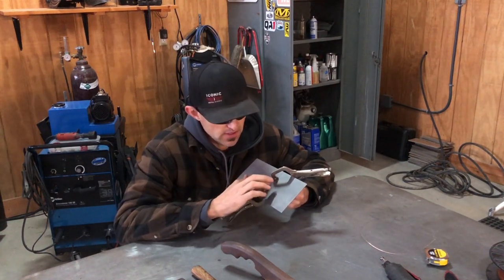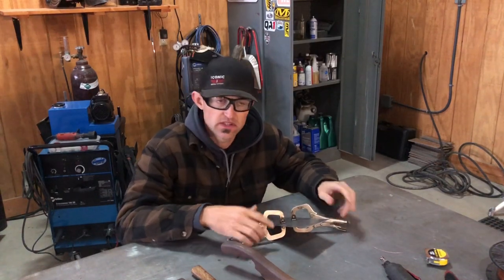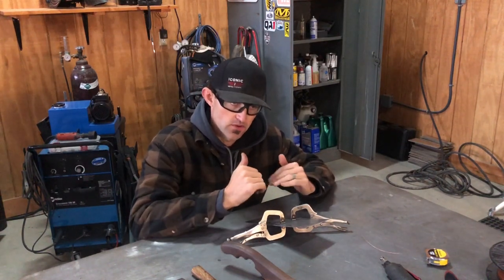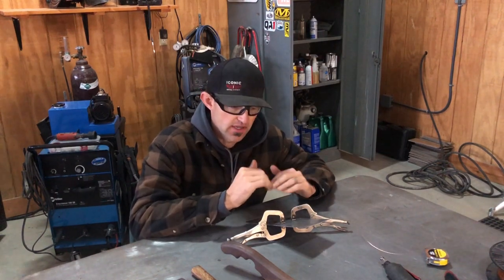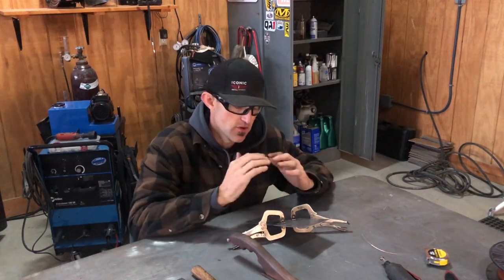Thing I wanna share with you guys is when you make these panels for cars, whatever you're making, you wanna make them long, 3/4 of an inch long. It doesn't have to be real long. When you go to make your final cut, you're gonna scribe it. You're gonna start with one panel and then scribe, and you want a perfect cut. If not, you're gonna wanna use a Vixen file, a body file, and file that metal to where there's no air gaps.